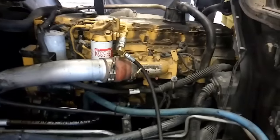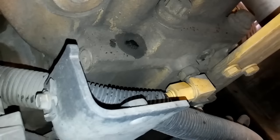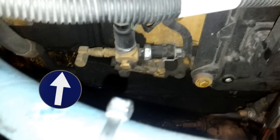First thing is a walk-around of the engine. On the intake side of the 3126 cat engine, on the back of the head, you're going to have your fuel pressure regulator on the right there next to the lifting bracket. And then starting in the back of the engine, you can see your ECM there — it's the black box with the lettering on it — your P2 connector, and your oil pressure sensor on your oil manifold. Also you can see your side covers there, and you can see the oil pouring out of them. Pretty common problem there.